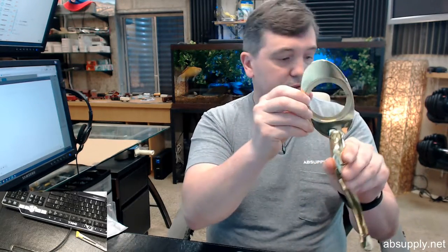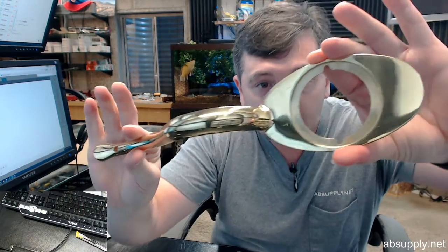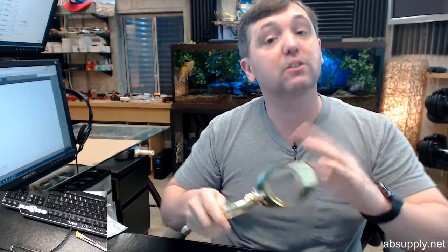Now, the other finishes, and I don't believe I've discussed the other finishes that this is available in just yet. At the time of this video, US3 for polished brass is better termed 605. It'd be more accurate to call it 605, because that tells you that it's polished brass and that it is a solid brass-based material, whereas US3 doesn't really tell us what the base material is. Just a little nuance of hardware. Antique brass would be a 609. Satin nickel would be 619. And then satin chrome would be 626. All of that is going to be on a solid brass-based material.